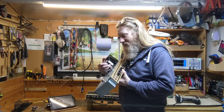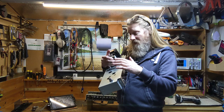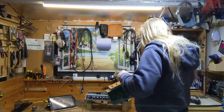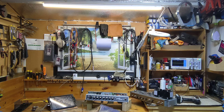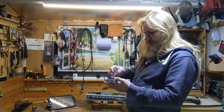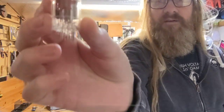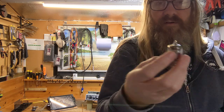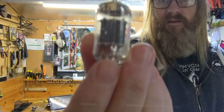Good tubes. But then in V2, V3, and the phase inverter — V2 runs the tremolo — so in V2, believe it or not, I'll get the tubes out. It says: 12AX7B China. That's that one, that one, and that's that one.